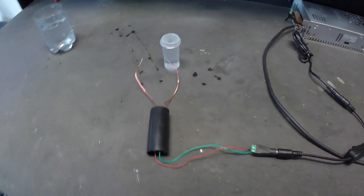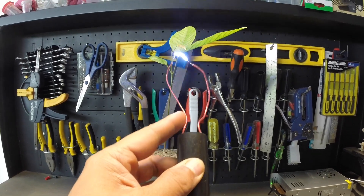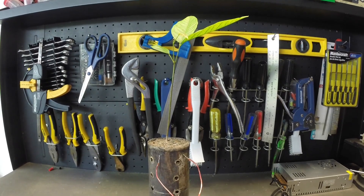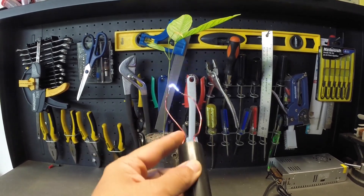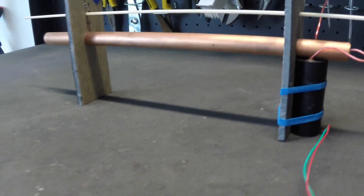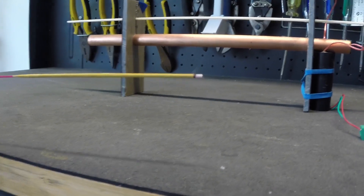...after playing for some time with the ionization aspect to make the barrier sparks, an EHD enthusiast will often turn the focus to how to increase the strength of the electric field between the two electrodes. The stronger the electric field, the stronger the force applied to the charged particles created by the emitter electrode. The stronger the force, the higher the kinetic energy of the charged particles as they collide with the air molecules in the space between the two electrodes.